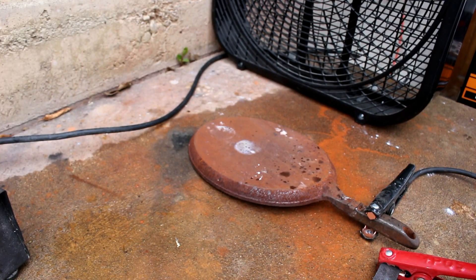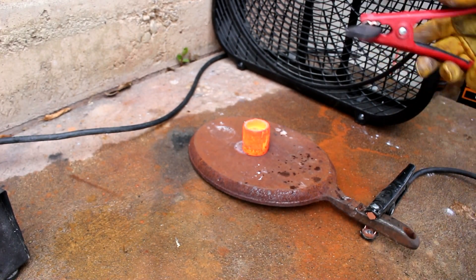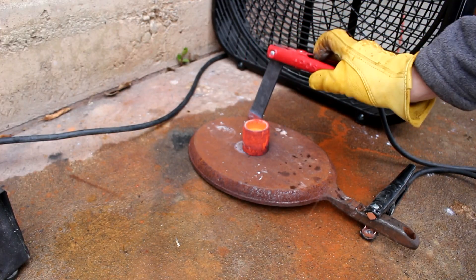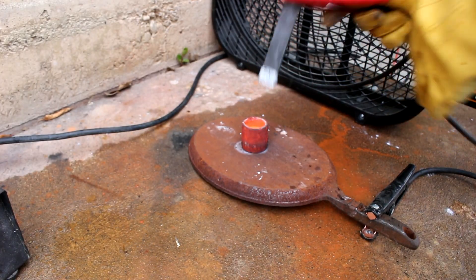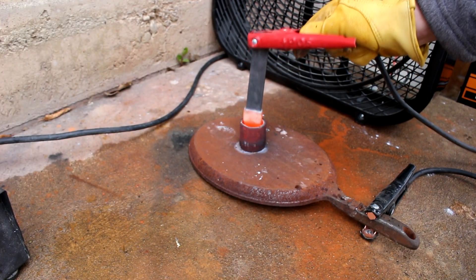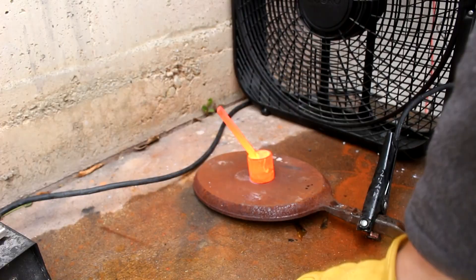Let's pull this out and see if we can do it. Looks like it's molten — that's a good sign. Press the shield down — there's the electricity. It doesn't seem to be producing much of a reaction. I see the problem: I'm not getting good contact. Let's turn up the current. It looks like my carbon rod is just cooling the cryolite next to it; it's not actually getting good electrical contact there. So I'm going to have to try this again. Maybe I have to preheat the rod.